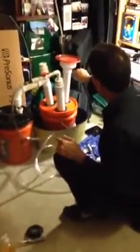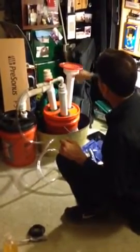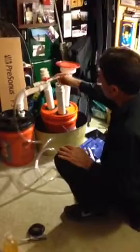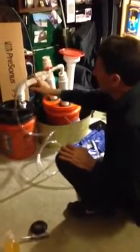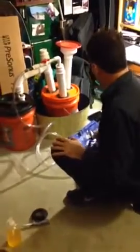Here's the digester actually operating, and you can see the food pipe. I've put a 4-inch to 2-inch reducer so that I have something as a funnel that I can pour the food waste into. The gas out has a reducer from 2-inch down to 1/2 inch, so I can go to my gas valve and then to my barbed nipple and then out to the gas bag.